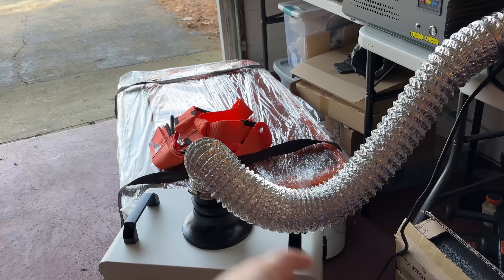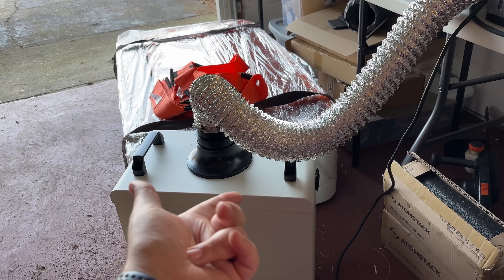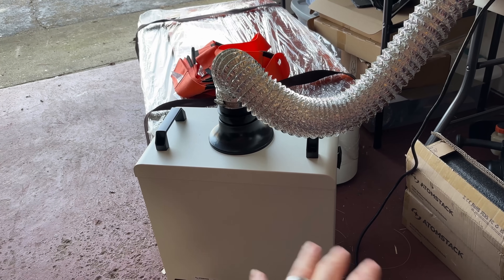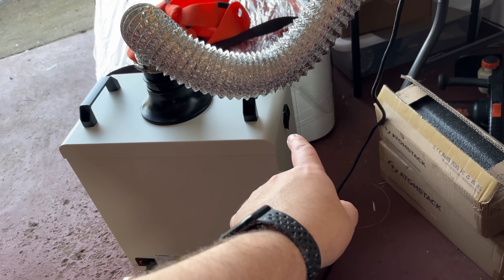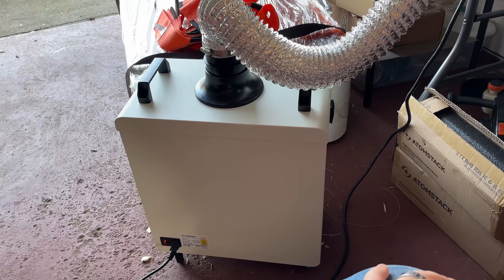The air vents are nice — goes right on, and then you have the optional air filtration unit which I really like. For wood I'd probably just plumb the exhaust out and maybe get an inline fan. But if you're doing aluminum business cards or acrylic, I'd use the filtration unit. The wood is going to clog the filter faster. I have two similar units from other companies and I don't like how they attach the top to get to the filter — this one has really nice latches, it seals down well, nothing leaks out, and it exhausts through a small port on the back. Perfect.